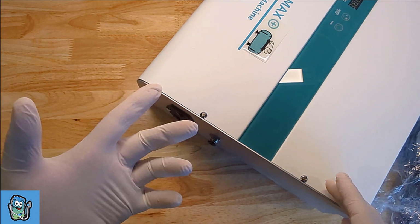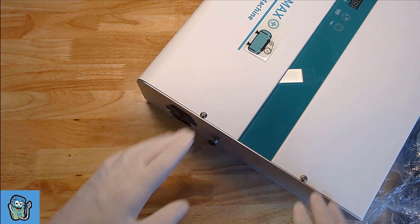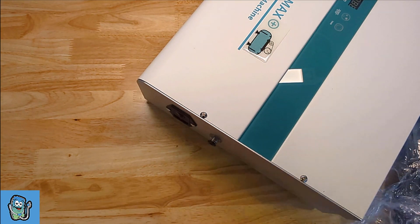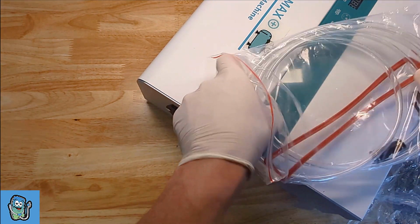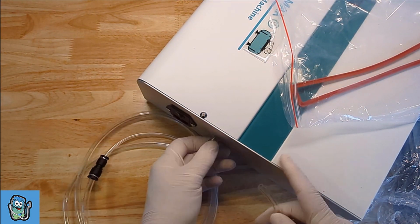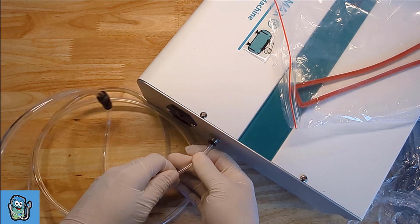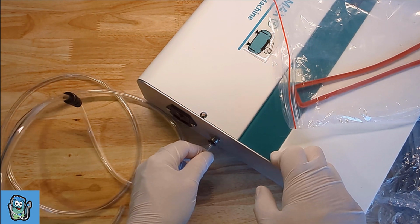Because if the power comes back on, you want to make sure that this breaker is off, just for safety purposes. And you also do have the connector for the hoses, and we will show you how it works if you've never connected the hoses before. It's basically a locking mechanism. So when you insert the hose, it locks automatically. It does not come out.